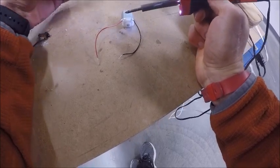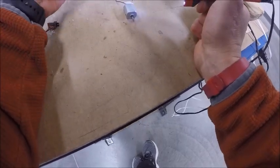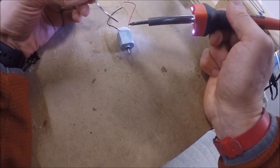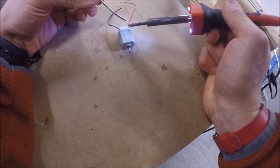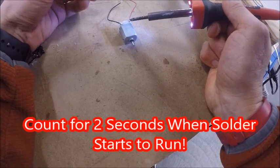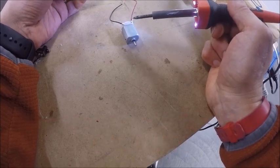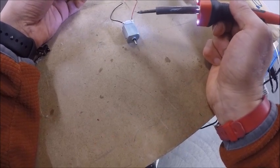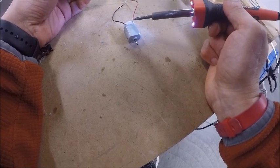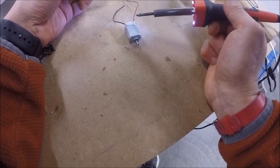So once again, if I go to the other one, and if you need to turn it around, you can. But I'm going to go ahead and put the soldering iron against the brass tab, bring the solder in, go 1/1000, 2/1000, letting it melt and run, and then moving it off. But you should see the solder kind of run like water, bonding to the brass tab. Right? It shouldn't just look like a little BB or a bead. It should run to the brass tab.